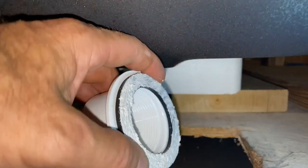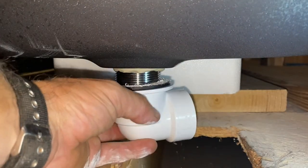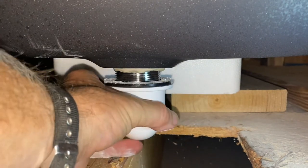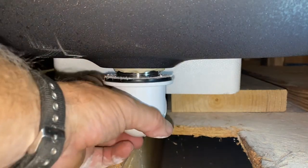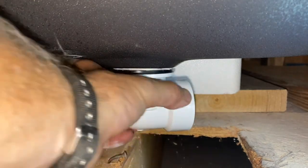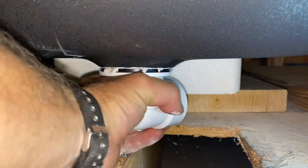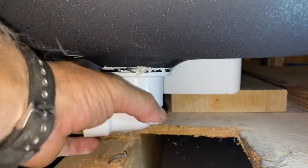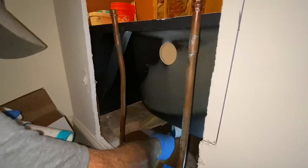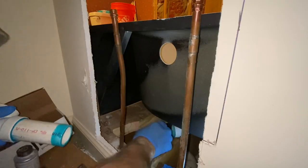With the offset in it — speaking of the overflow, here we go. I've got plenty of putty on the metal part of the shoe and we've thrown a little pipe dope around that rubber gasket right there. When I tighten this shoe on here, I like to get it really snug but not so tight that I can't move it around — you never know how you're going to have to twist it, especially if you're making an offset. Now that we've got that shoe twisted to a good starting point to avoid that joist and the beam under it, we'll get the measurement, glue the T on, and get the T leveled up.